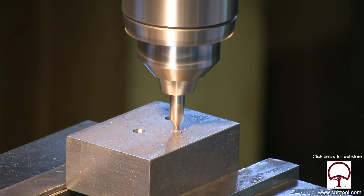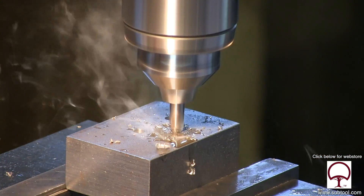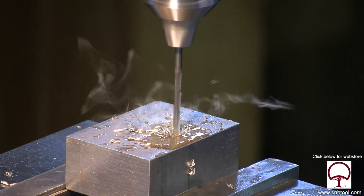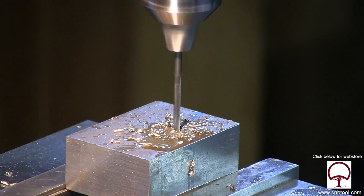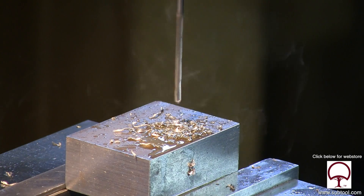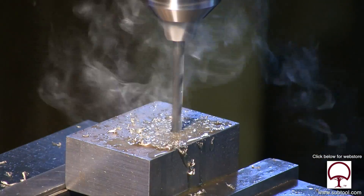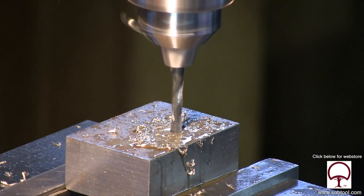Now we're going to center drill and drill another hole for the purposes of using the inexpensive drill. Here's our pilot drill — again, it's out of the same case. This is an inexpensive drill. We're going to go all the way through. I like to use a little bit of cutting oil on a regular basis. Now here we're putting in our quarter-inch drill that we used in the prior video — the point was off center, so we took it to our drill point sharpener and put a brand new point on it.